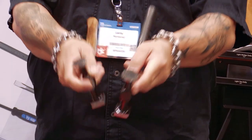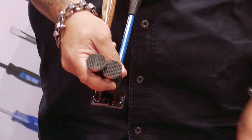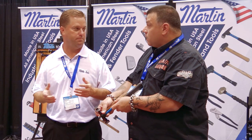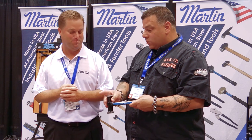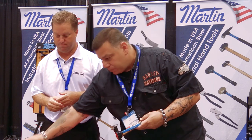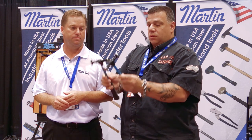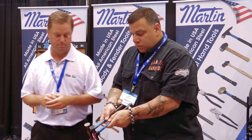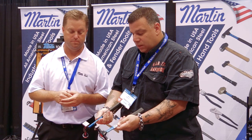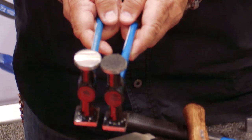The big difference is you can see that both of these hammer heads have waffle edges, which are used for shrinking. I can't shrink aluminum and it'll leave marks, so the waffle face is for steel. But this identical hammer here has clean faces — no waffle end. These are identical except one has the waffle face and one doesn't.